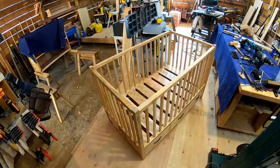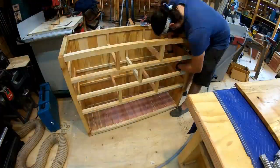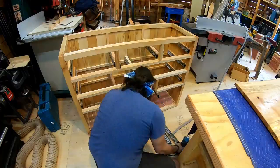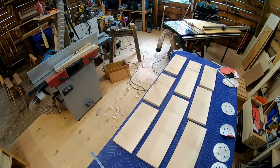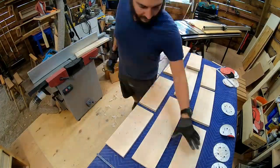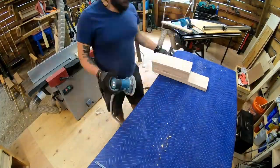Some details are hard to get across in the video — very small, subtle things you only see when you look closely at the piece. All the top parts of the crib have a very slight curve to them, and there are little chamfers and tapered chamfers where I used a spokeshave to almost make a curve along the edge of the vertical pieces. All these little chamfers and curves serve to visually lighten the piece. It's not something you can immediately identify, but a piece without chamfers looks sort of heavy — once chamfered, the whole piece becomes lighter, even with the same mass and strength.